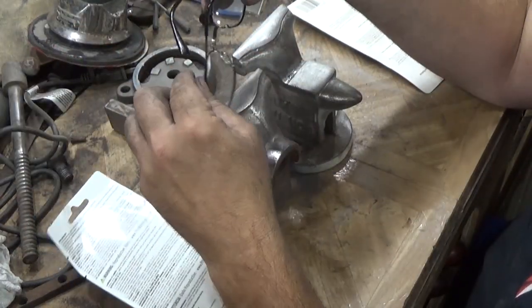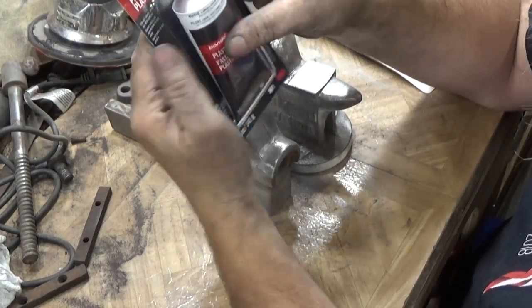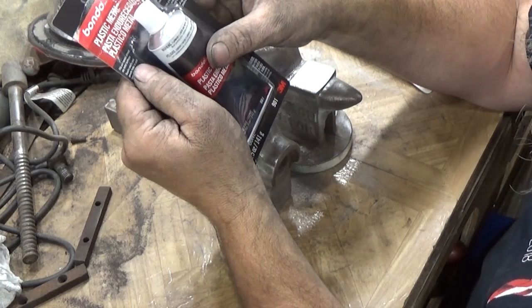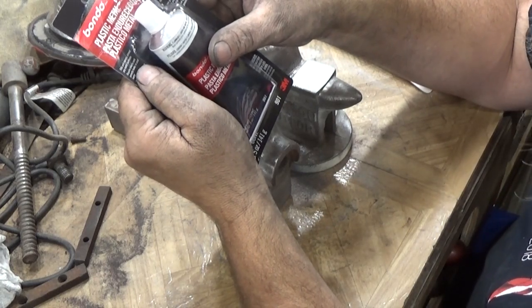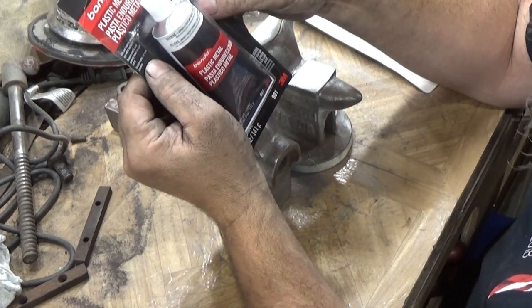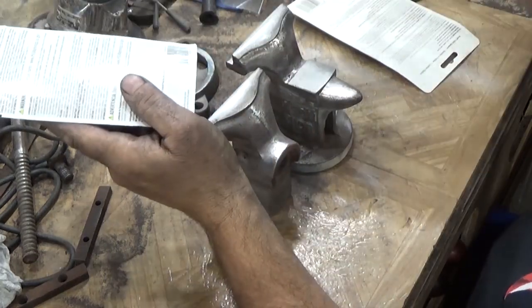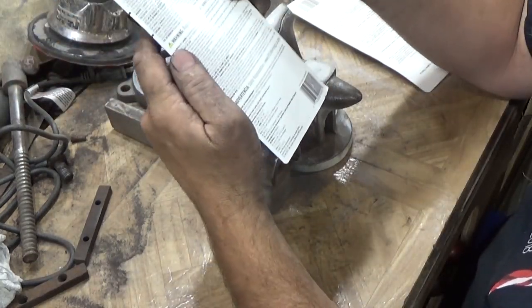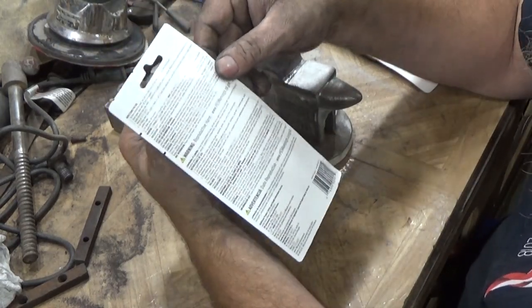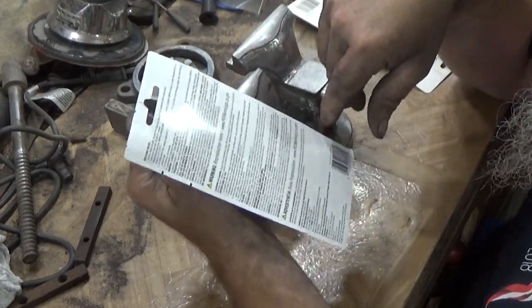This is going to involve glasses. Plastic metal fills and repairs almost any metal surfaces, repairs cracks, porosity leaks in cast metal, resists water, oil, and gasoline. So I just want to fill the holes. I don't think I would trust it for structural kind of stuff, but for filling these little potholes in a bad casting, I think this is going to be just the ticket.